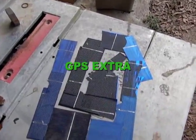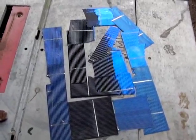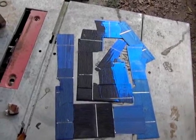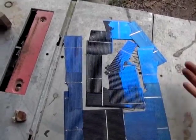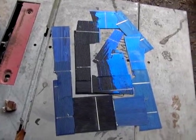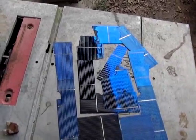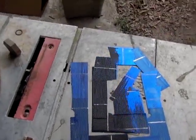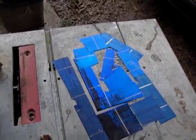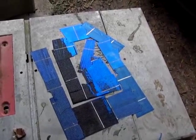Here is the configuration right now with 15 cells. This produces right at 7.5 volts and it's probably 7 to 8 watts. One of the things that people who go to developing nations or third world countries where they have no electricity want to do is take a whole bunch of cells over there, tab them together and protect them — but they have no way of soldering when they get there. There's no electricity, and a soldering iron can be 80, 90, or 100 watts. With this method, people with no experience can basically put these together. Any scrap solar cells could go to people who need them — they could do it themselves in a matter of a day and have a little bit of electricity.